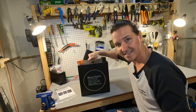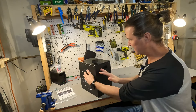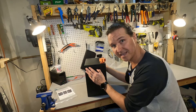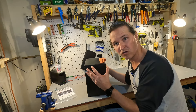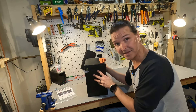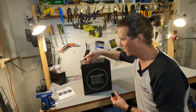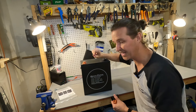The first thing I like about this is that it's metal — it's not a plastic case. It does have handles on the sides. On this side it has an on/off button which I really like. I think with this on/off button we won't need to use a resistor when connecting up large inverters — we can just connect the inverter, turn on the battery, and everything will be fine. The terminal covers just pop right off, and the terminals are raised up a good inch so you don't have to worry about touching the terminal to the metal case.